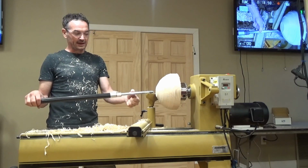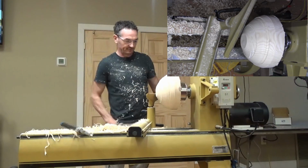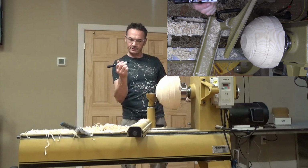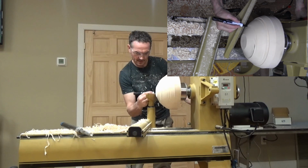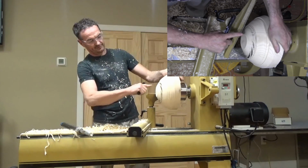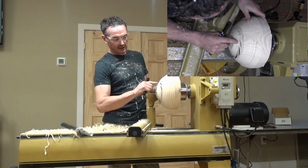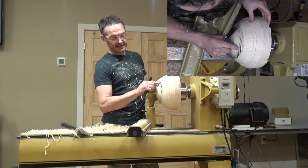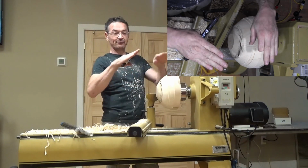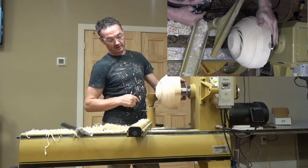Although the thumb is pushing down, it's a round bar, so it's still pushing it in. By pushing it in, you get this reaction. You can see the bounce wave. You see it's a wave, it's always a wave. There it is, see it's a wave. It's a bounce wave. So what ended up happening is when I took my fingers away from behind, my thumb was pushing in, you can see where the side grain is, it compressed slightly, and then the end grain resisted and pushed it back, which made a rocking motion, and then it cut a little channel. And then when the bevel engages that little channel, it drops back in and accentuates the rocking motion, that's why it grows bigger and bigger and bigger.